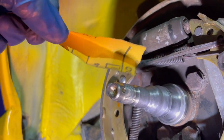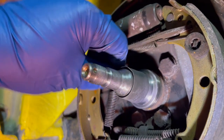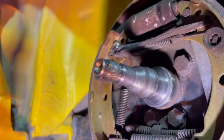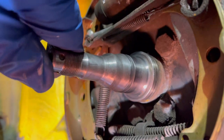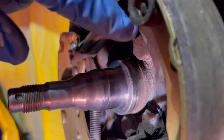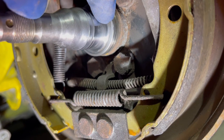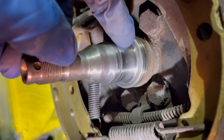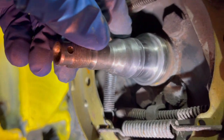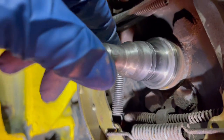My little buffing wheel was taking way too long, so I now have a piece of 600 grit wet-dry sandpaper folded in half. I've been pulling it across with two hands, working it around quickly. The really shiny areas are the areas that are really high — the sandpaper is just taking those down. Do you see that dull area right there? That's the area that had a lot of rust on it, and it's dull because it's still a little low. When using the sandpaper, make sure you go all the way around and keep it even as you work it.